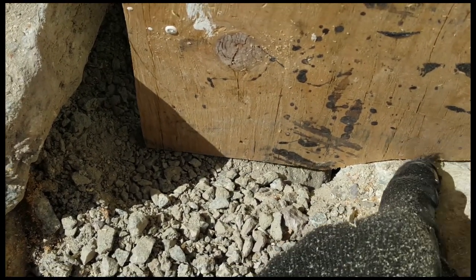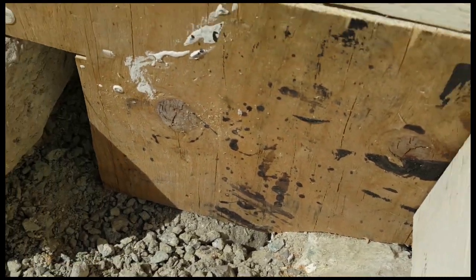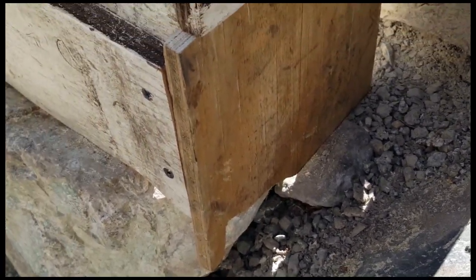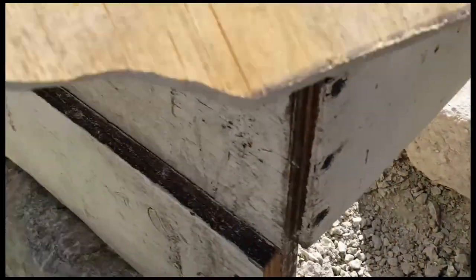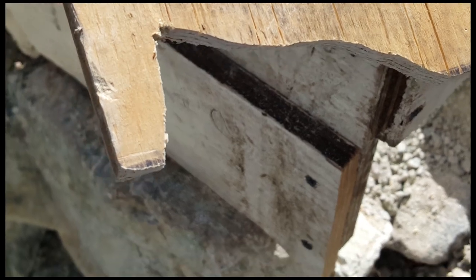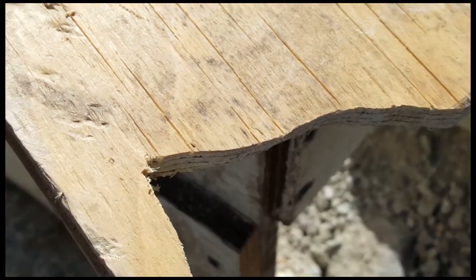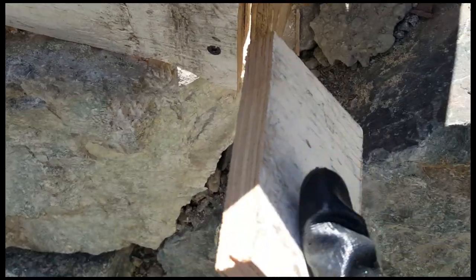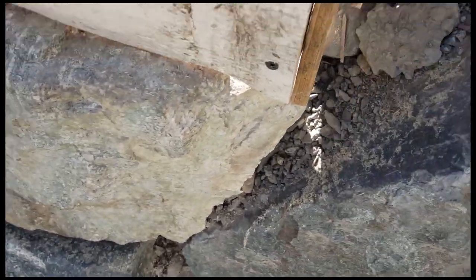It's quite critical here around the rock — I wanted to seal it so that I don't get concrete leaking out. It's finicky work on the outside here. I'll just fill this gap in with a rock. But as you can see, the cut itself is kind of finicky, but if you take your time with the jigsaw, mark it from the inside and nip it off, you get a decent fit. So we'll go ahead and install this — hard to one-hand it, but there it is, let's fit it into place.